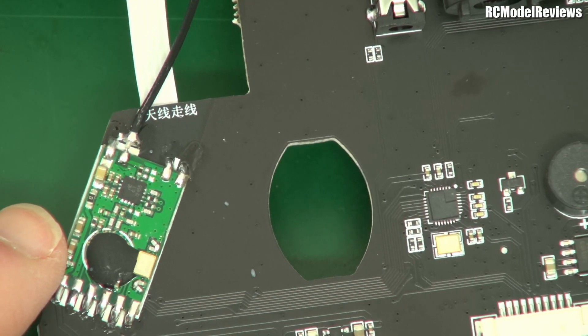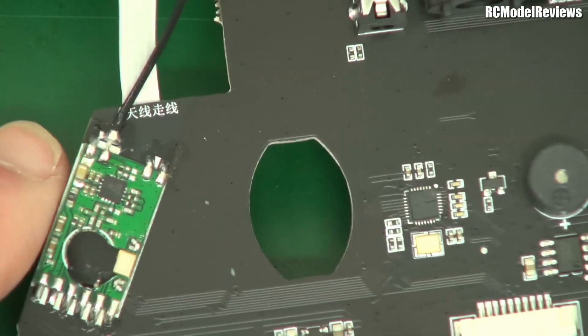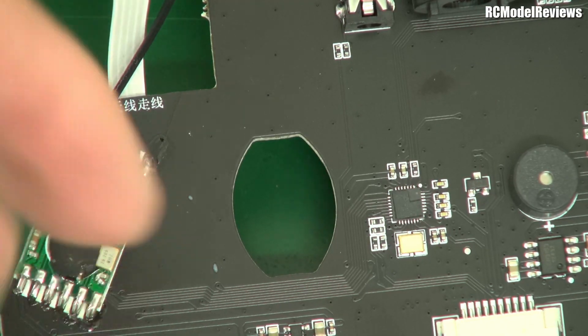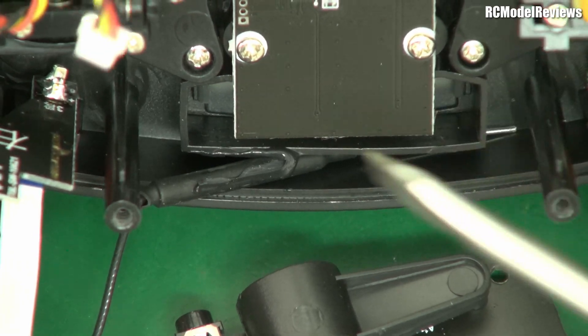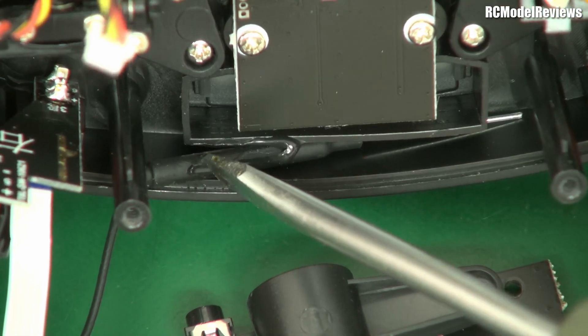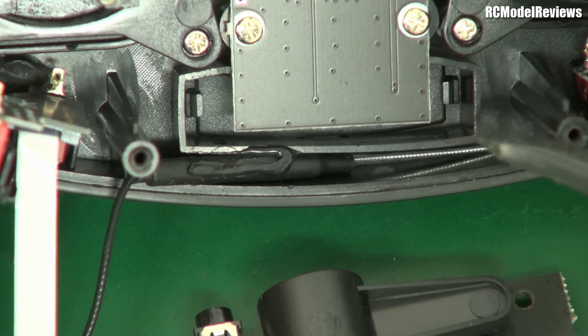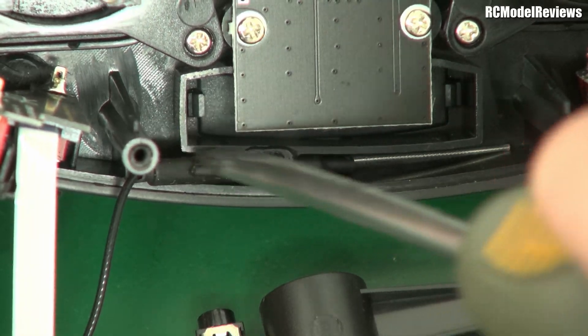The RF module is where all the goodness is — it's just the Texas Instruments CC2500 chip with a little amp on the end. It fires out to an antenna over here, which is just a sleeved dipole — what we're so familiar with seeing inside those rubber ducky antennas. There's the active element, the shiny bit down there, and then a sleeve to act as a counterpoise.